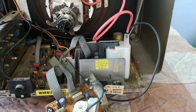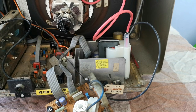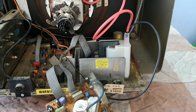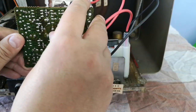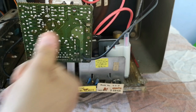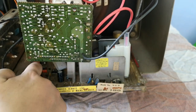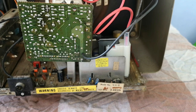On the 10th of the 8th 2004 there were repairs to the frame circuit and a general tidy of the print, so this isn't the set's first repair, and for a set of this age that's not unexpected. The back has been off a few times during its life, but given that its life is over 30 years, I think that's pretty good. We'll put this neck board back on. Certainly the next step is going to be to replace this frame IC, because the symptoms we're getting do seem very reminiscent of a frame synchronization fault.